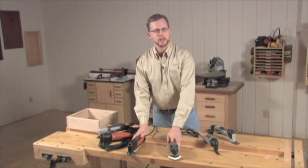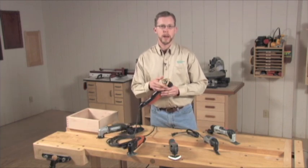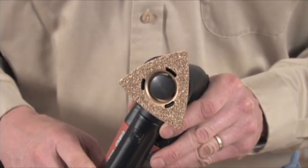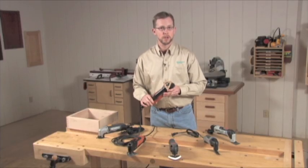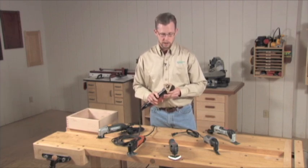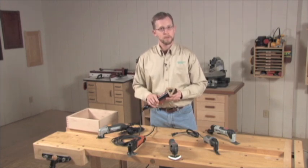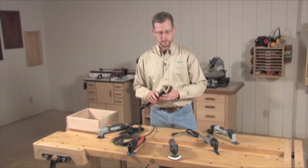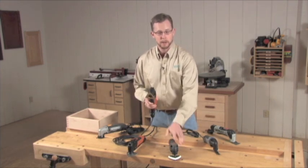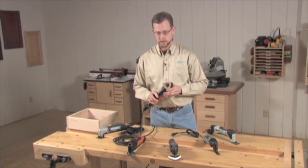But you're not limited to sanding with multi-tools. You can also get much more aggressive attachments for these tools. For instance, this one has carbide particles that are impregnated on it. It's meant for masonry jobs. So say, for instance, you're popping up some ceramic tiles in the kitchen. This is the kind of blade that can help you take that thin set mortar up off the floor so that you can replace those tiles. The same oscillating motion that enables really fine detail sanding applications also can cross over into more aggressive applications too.